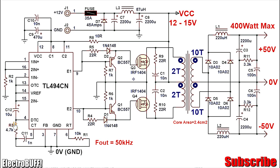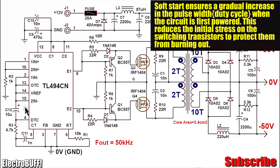Capacitor C12 and resistor R serve as a soft start circuit. This basically ensures that when the circuit is initially powered, the outputs at E1 and E2 will increase in duty cycle from zero up to the set point — in this case the maximum, which is about 48 percent on each side. Initially capacitor C12 is discharged and acts as a short circuit, preventing the full 5 volts from pin 14 reaching the dead time control pin 4, ensuring the duty cycle is minimum. With time, C12 charges and the potential at pin 4 slowly decreases to ground, allowing the dead time to decrease from maximum to minimum.